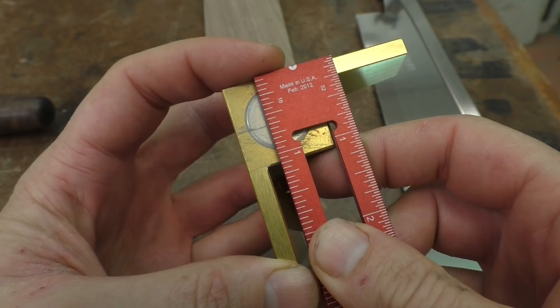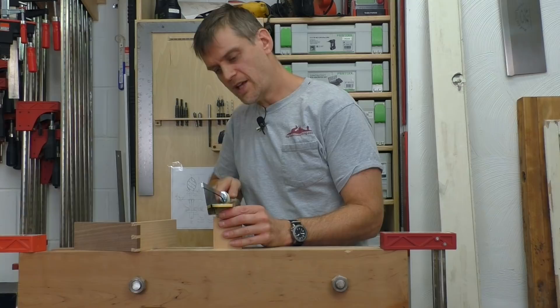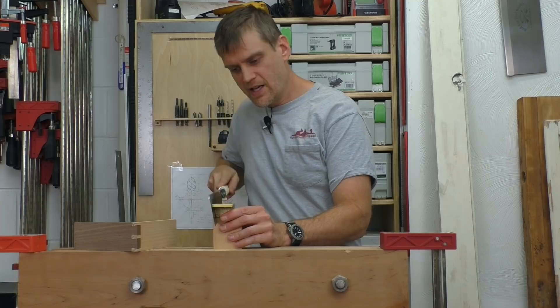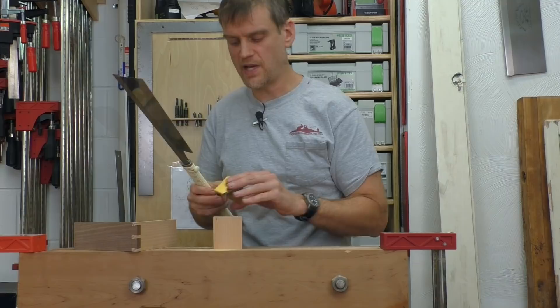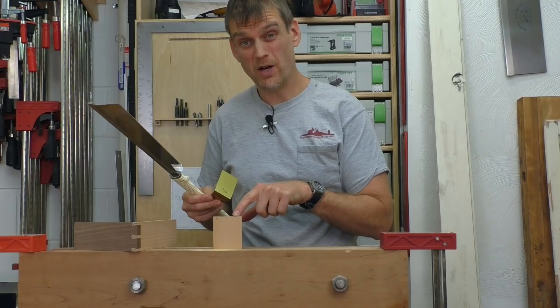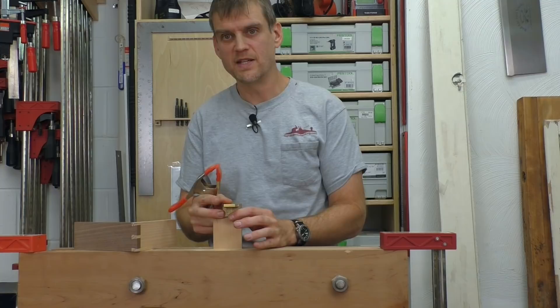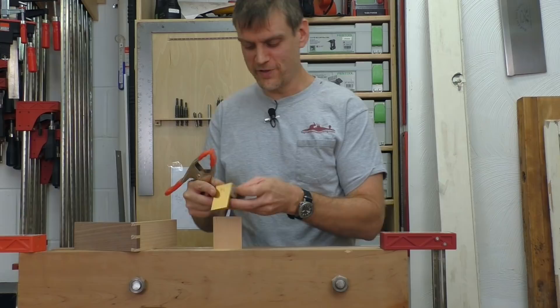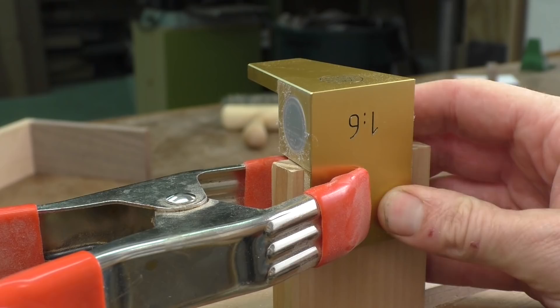As you saw in making the dovetails, the jig is reversible so you can use both sides. For making tails or pins, I like to cut on the right-hand side because I am right-handed — rather than using the left-hand side, which is pretty awkward, I turn the board around and use the other side. Just be aware when you do that, you want to make sure you have marked the top of the board, because if you mark the face with where your dovetails go and you turn it around, you no longer have those lines to work from. The friction pad holds the guide right in place — it works more beautifully than I would have even thought. But if you want, you can use a small spring clamp to hold it in place while making your cut.